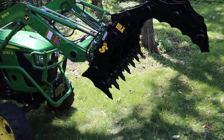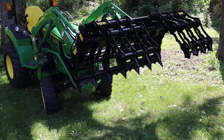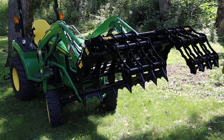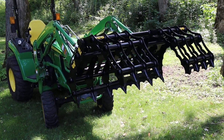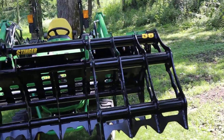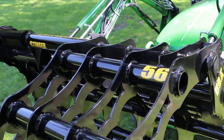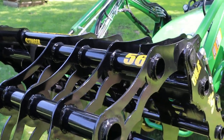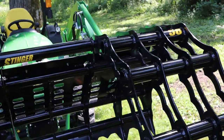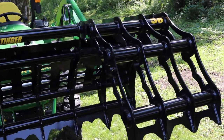For testing on the R&D side, we actually put this grapple on one of our wheel loaders at the shop and were rolling concrete blocks with it, trying to wreck the grapples. I'm not saying they're indestructible by any means, but we've been putting it through the ultimate test — we'll show you that in other videos. We feel we're pretty limited in what we can do on a computer for design and strength analysis, so we get the full test by putting it in real-world, everyday situations. You're going to notice a lot of gussets and a lot of tube throughout this.